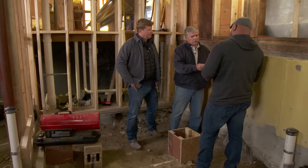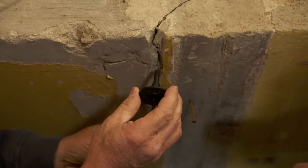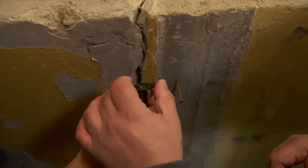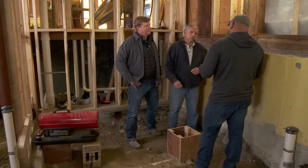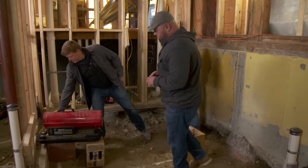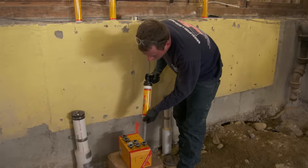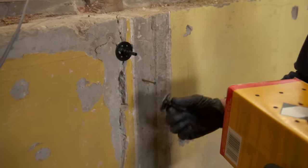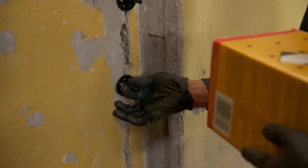When I see this thing, I thought you had to drill holes and insert that way, but you're going to mount that on the wall this way — surface mounted using epoxy. We're going to rely on the epoxy to hold it in place. The only issue with today is the temperature; it's a little cold, so we're going to have to run a little heat. Ryan's going to butter up the back of these things and then surface-apply right over that crack on the wall.